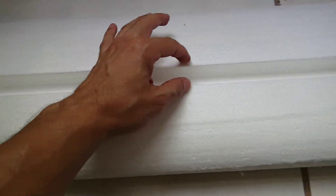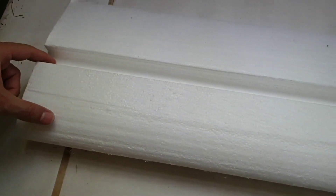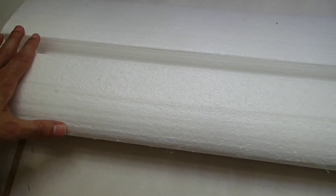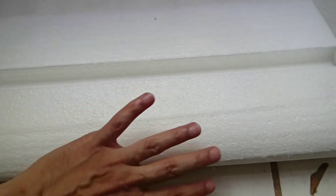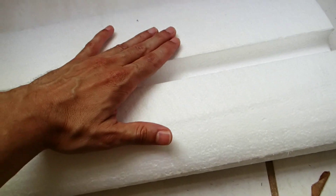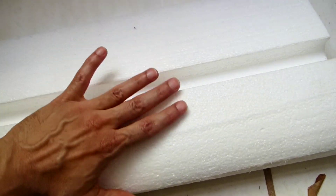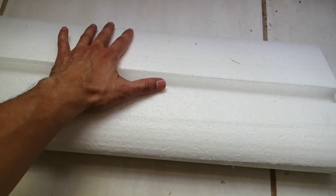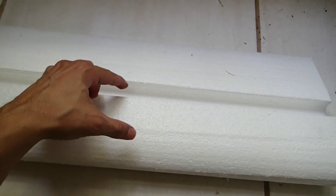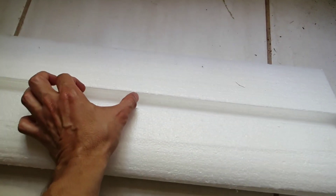This is a piece of foam I already cut with the foam cutter. Here you can see the shape of the airfoil and also the groove to put the tube. After I put the tube in, I'm going to cover the blade with the aluminum sheet all around. After you cover it, you need to put some clamps for several minutes to allow it to glue. With that glue I showed you, it shouldn't take too long to set, but it's better to leave it for several hours. After you finish covering it, you can drill the holes in the tube and attach the brackets.